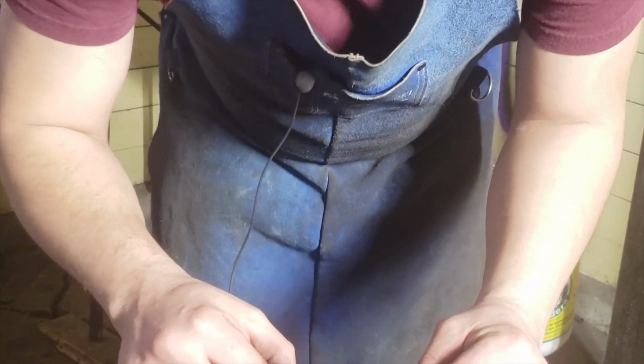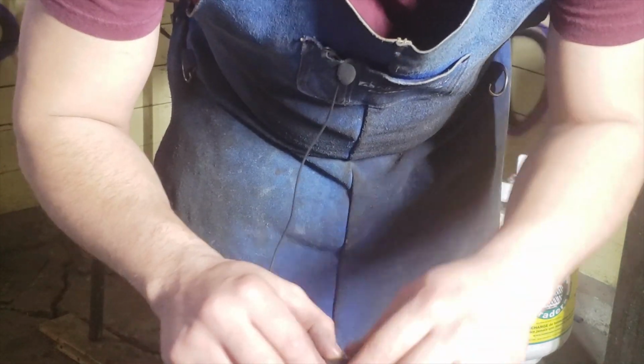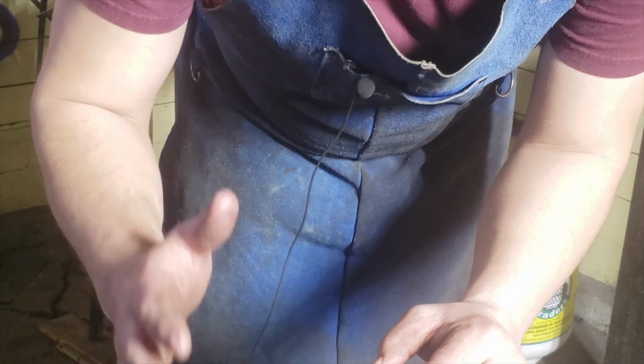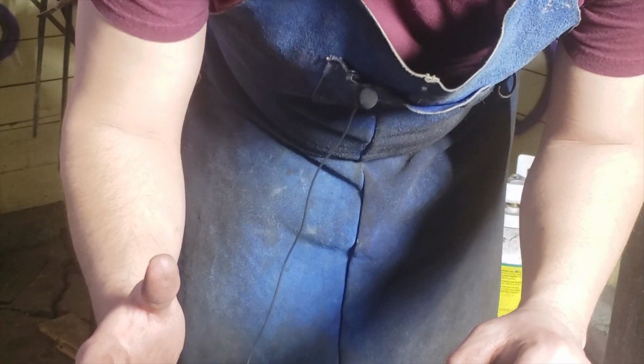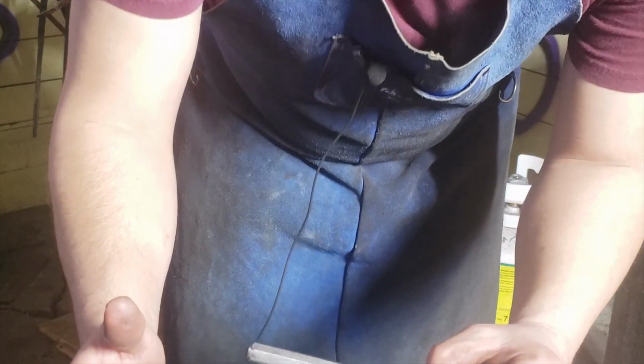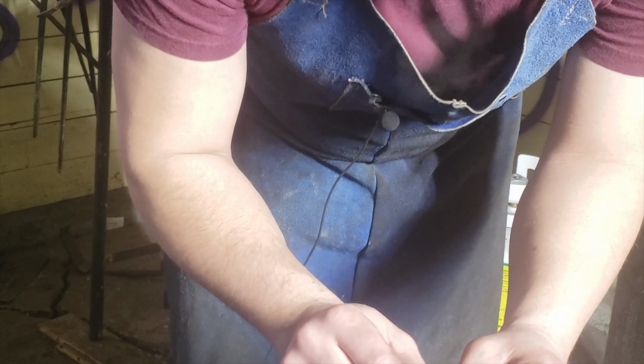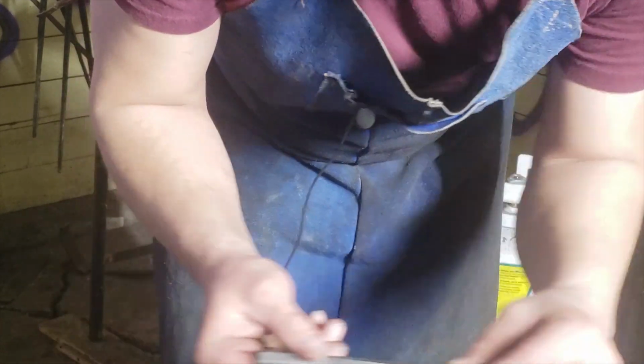Okay, so now that one side you've turned into a nice square taper. The rest of the 4 inches, taper that out too and draw it out nice and long. You'll have to have a look on the length. I'll measure it after, but the length of this determines the size of your hook and the part where you need to strike with a hammer into your stump.